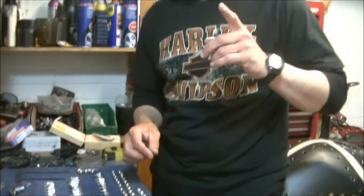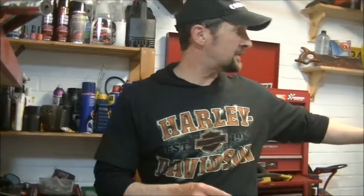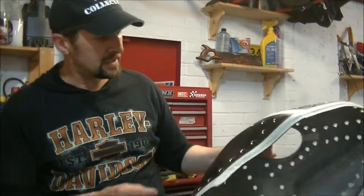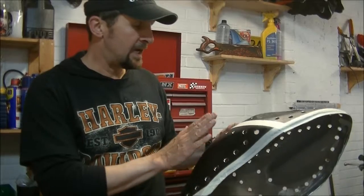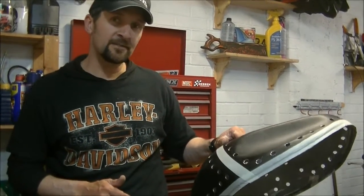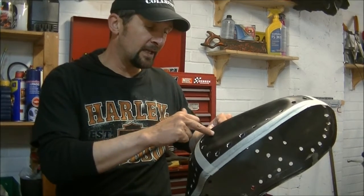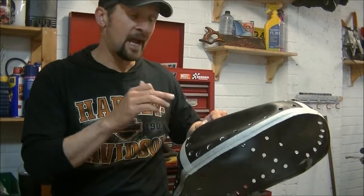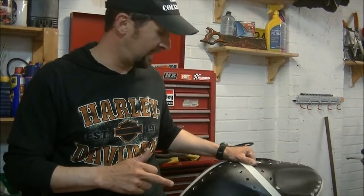Mainly because I'm not welding. I'm not going to weld the surface of the new tank, mainly because you've seen how thin this steel is. It's literally 22 gauge steel, and my welding, well, I don't think anybody's welding, unless you are a real talented, gifted person, is up to making sure you can put a really meaningful tack weld in there that will hold and not crack off and not blow through it. Blowing through my new tank, enough of the tank's leaking, so we just glue it on. Simple as that, and it's petrol safe as well, as I've proved, because I tried to use petrol to get that off my sockets and it doesn't come off.